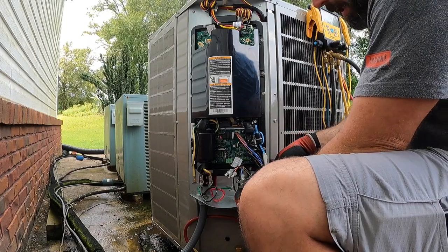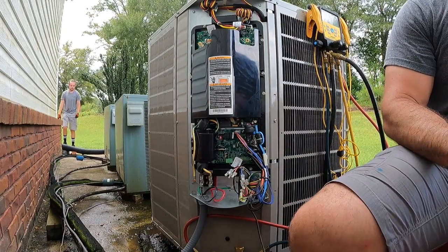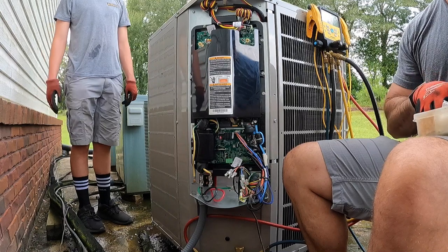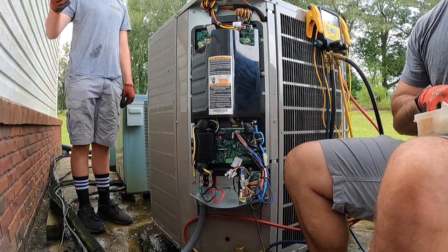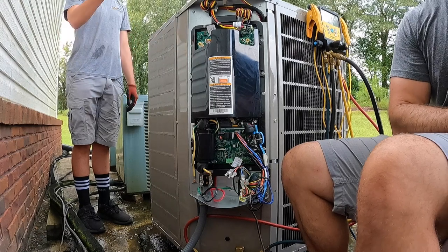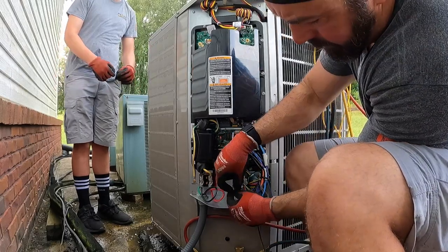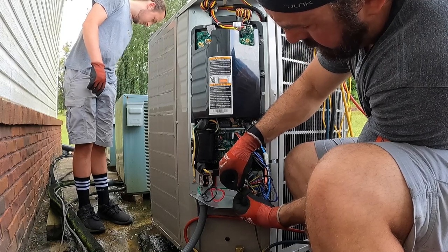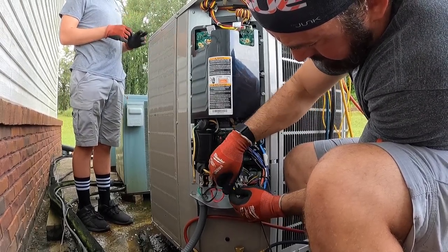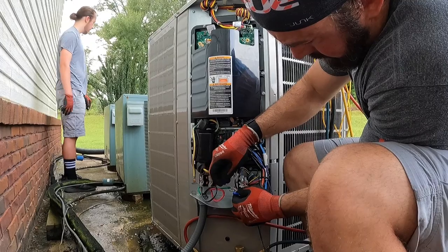On the inside unit to the thermostat, that uses four wires. I'm going to end up zip-tying the thermostat wire — our low voltage wire — to the liquid line. Code here does not require this low voltage wiring to be in a Romex connector, so sometimes we do it, sometimes we don't. Nobody's going to be back here cutting grass or walking through this mess, so we don't have to worry about it getting yanked out. My helper is asking about a Schrader valve core that came out when removing the insulation — I told him it'll go back in the small side, just don't lose it and don't get pocket lint in it — it's a strainer.